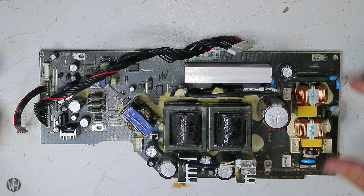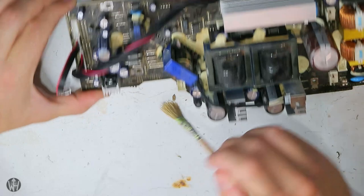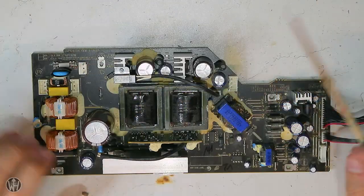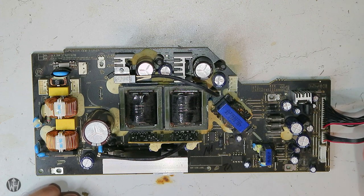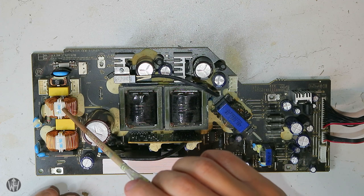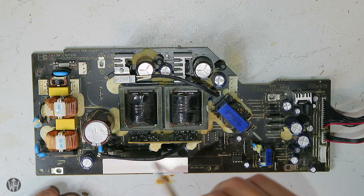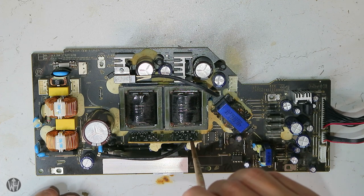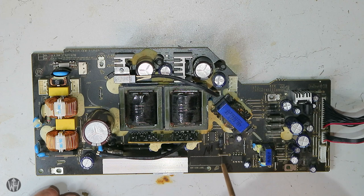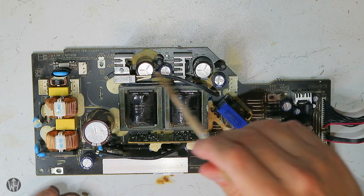Let's check the power supply. I already looked around and literally found some bugs on it, but this is not the reason for the blowing fuse. Let's roughly understand how this power supply works. The AC comes in at this point and goes through a fuse, an AC filter, and an inrush current limiter for the bulk capacitor. Here we have two semiconductors and some logic ICs, so this is probably a combination of PFC and DC-DC, because after the two semiconductors we have two transformers and two more semiconductors.